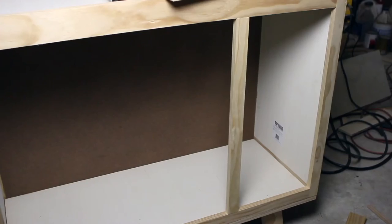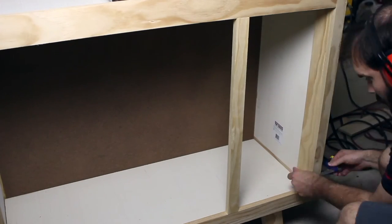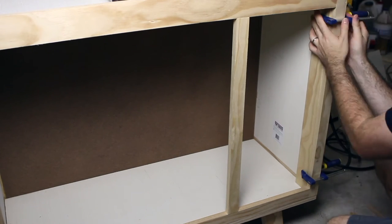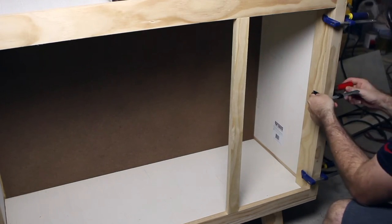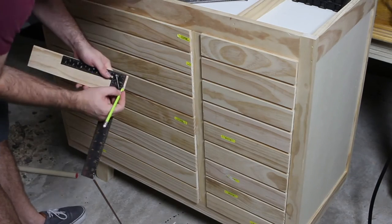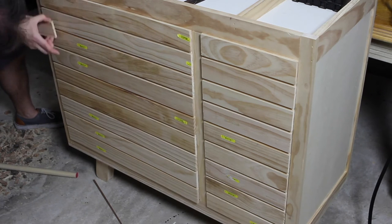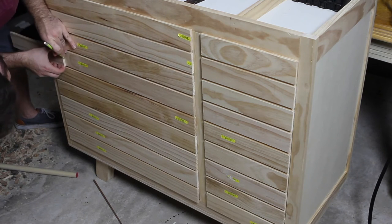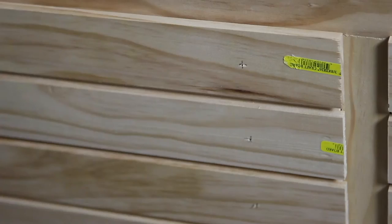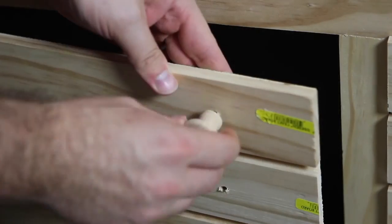To prep the changing table for the door hinges, I glued a 1 by 1 and a half inch board to the inside lip of both sides of the cabinet. This allowed a thick board to screw the hinge into and hold the door securely. Once the door was attached from the inside by screwing in the hinge, I marked the holes for the knobs by making a template out of a scrap piece of wood, then drilled the holes slightly thicker than the screw for the knobs and attached the knobs.